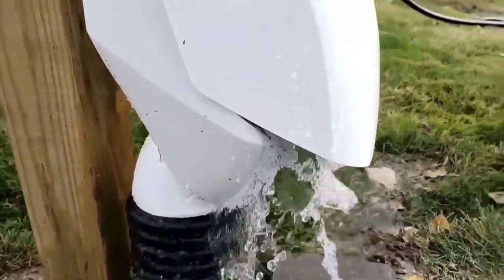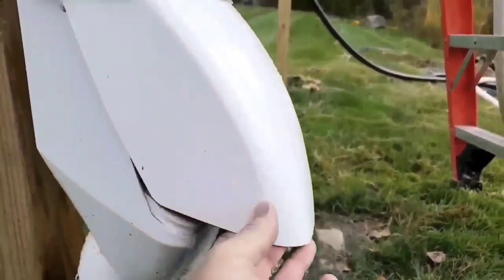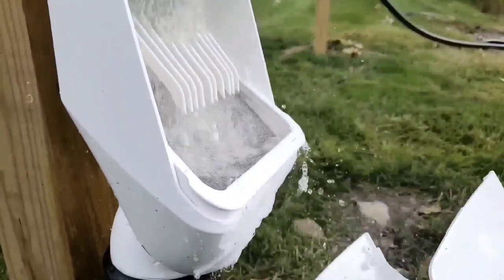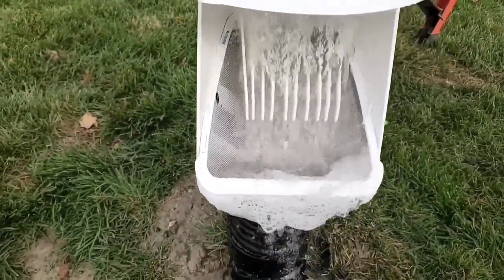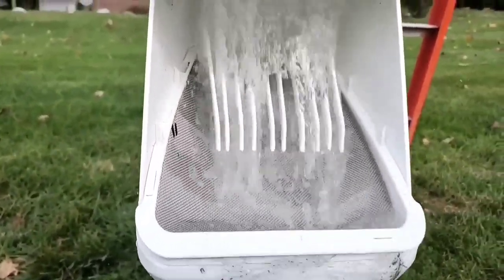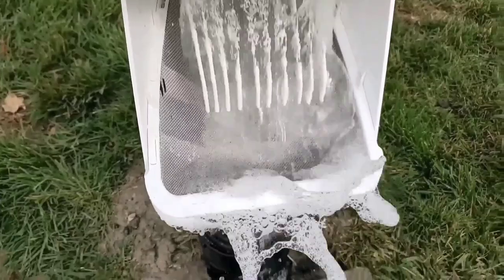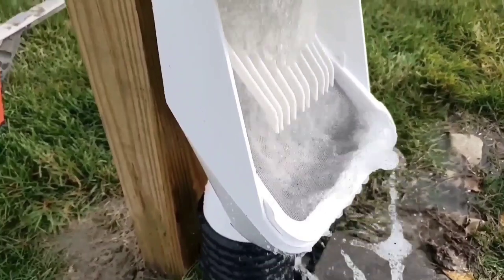As a contractor, all these things that I see on the market and the way that they advertise and solicit them — for rainwater harvesting, for somebody who is going to be patient with the process and vigilant with cleaning the screen, this might be a good leaf filter for you. But that really tight screen, when it hits during the torrential rains, you're going to have water escape. You're going to have water at the foundation, settling at the foundation, and you might have some staining on the house.